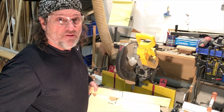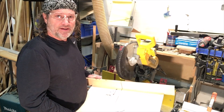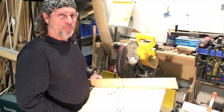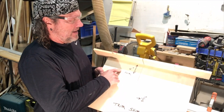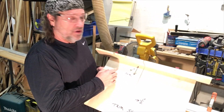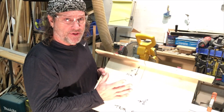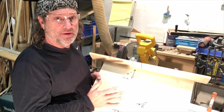I've made a trim shim jig to fit into the Kaizen Miter Fence Pro Plus system. I like to make four-inch shims and I like the grain to go toward the blade, so I'll cut it out of scrap windowsill material — 1x6 base, 1x8 base — anything scrap on the job becomes trim shims.